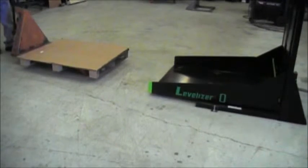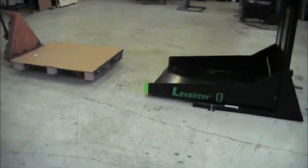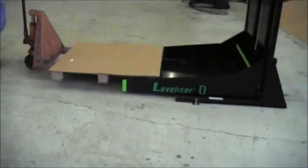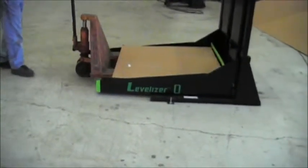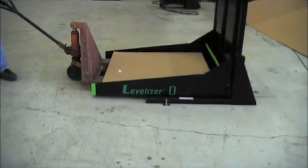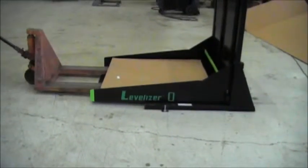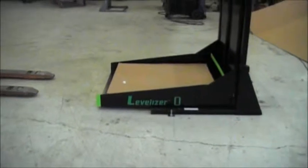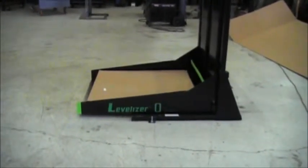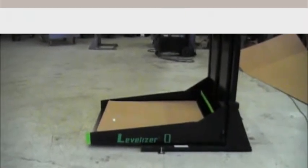Make sure that your pallet jack is above the pallet itself. As the operator shows, you can take the pallet, go right onto the pallet jack, disengage, and remove the pallet jack. As you remove the pallet jack, you will then want to go to the backside of the unit and hit the auto-lock.